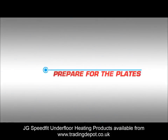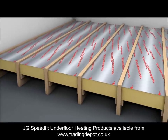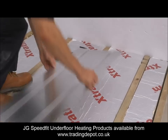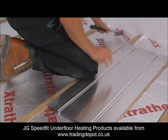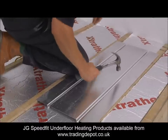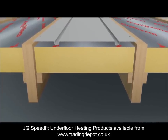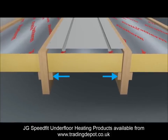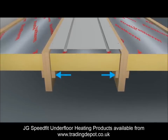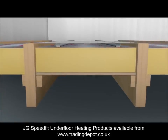Prepare for the plates. If fixing directly to the joists, be sure to employ safe working practice. It's important to make sure the plates are laid flat and flush to the floor, and also important to prevent heat going down. The best way to achieve both aims is to support the sheet insulation between the joists. They should be supported by battens fixed to the side of the joists, 15mm plus the depth of the insulation down from the top of the joists. If the insulation is not deep or strong enough, a further supporting ply board may be needed.